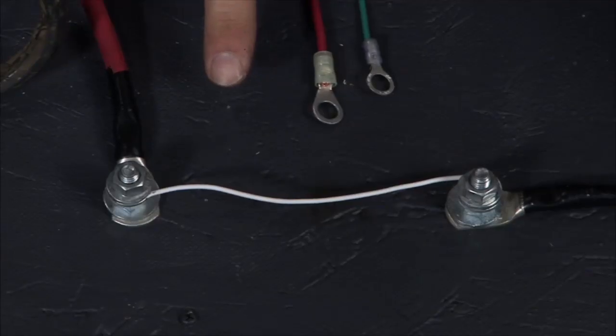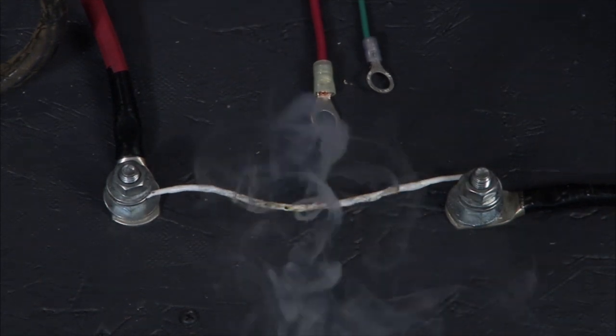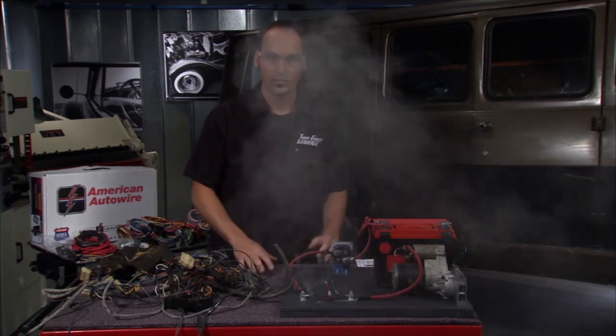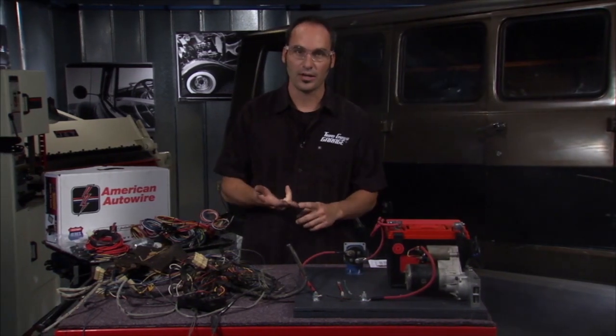Check out this wire here. It's going to start heating up. It's blowing too much current — now called letting the smoke out of the wire. You can see it's getting red hot in there, and I'm going to shut it off because I think you've seen my point. Using the wrong gauge wire, frayed wires, and corroded wires are all bad.